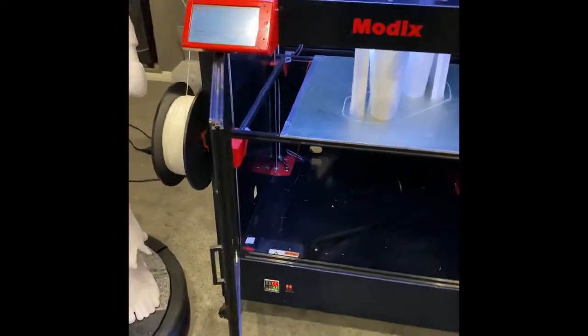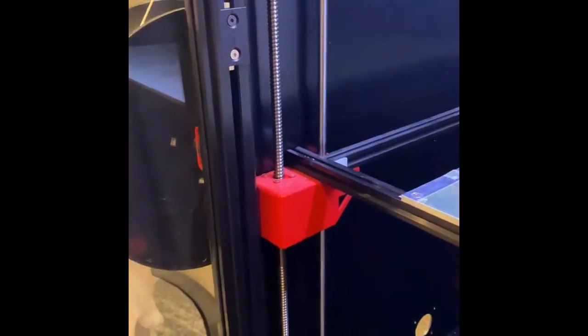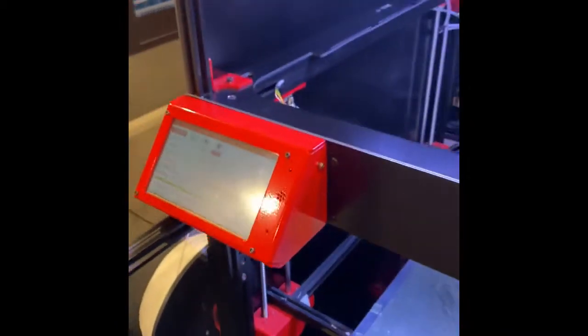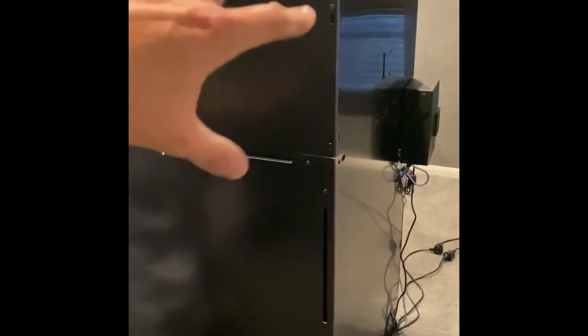So when we're talking about the machine, it's got awesome capabilities, but before we go into that, let's just have a look at the way it's built. It's a full 40-40 aluminium extrusion with a 3 millimeter composite aluminium panel for the enclosure. Now, the Big 60 doesn't come with the enclosure. It's actually an option. When you buy the Big 60, you have the option of getting the full 3 millimeter composite enclosure, which I do highly recommend.